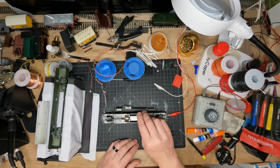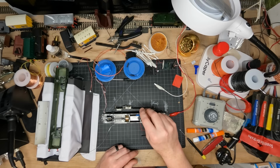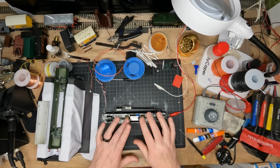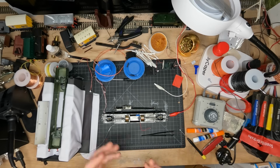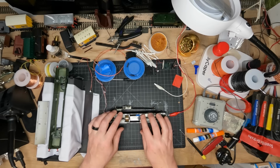So we unsoldered the motor and tried to run it that way, and I noticed when I tugged on the black wire, it gave a few problems, like it cut out a few times. So I resoldered the black wire and it ran fine for a little bit, and then ultimately it started exhibiting that loss of power again. So I suspect the problem is with the motor.